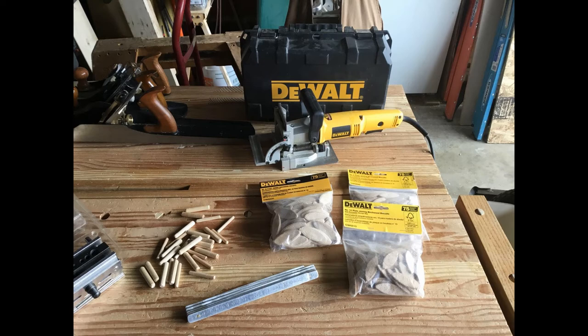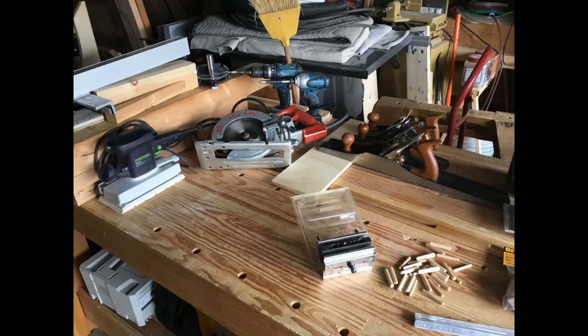And then the dowels. The doweling jig is off to the side. I'm sorry I don't have a good picture of it. I cut it off. I have another picture if you can see it, but this doweling jig is built like a tank, and it is really accurate. It's time consuming, yes, it is not fast at all, but I think doweling, if you know how to do it accurately, is a good way of joinery. And again, if you're in a speed run, you've got to go to pocket screws or something. I definitely believe it. Yeah, the Kreg system is extremely fast, will do the job. But it still doesn't have the same structural value. But, you know, take it for what it's for.